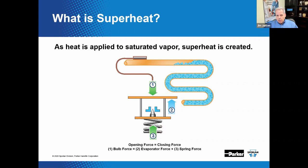The internal features of the valve that influence capacity include the stroke or length of the push rods, the diameter of the port, and the angle of the pin. Bleed ports, sometimes utilized by OEMs, essentially add to the overall port diameter and provide unregulated flow, which can add to the performance of the valve.